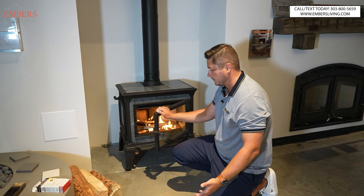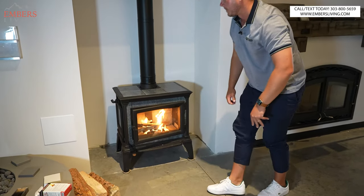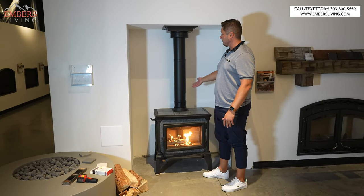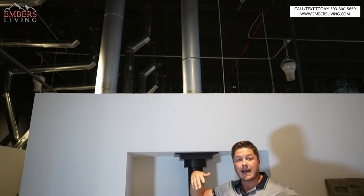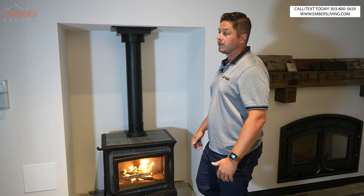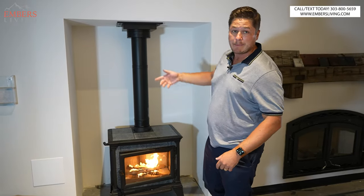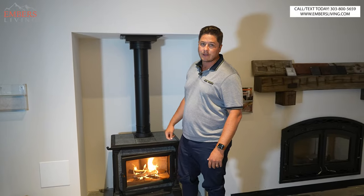Also, if you weren't aware, the stove is going to perform based on your pipe run too. Let's say I have a particular pipe run — in this showroom it's kind of unique. I only have three or four feet of black pipe, I have my ceiling support box, and then I have my class A chimney, which is my insulated pipe that would normally run through your attic and then outside of the house. Typical stove installations require at least 15 feet of pipe so you have enough to get a draft going. The longer you run, the more aggressive your draft is going to be. The more class A pipe you have — which is insulated pipe — it's going to get and stay warm easier and faster than a single-wall pipe. Single-wall pipe can obviously be ice cold very easily and quickly because there's nothing to it.